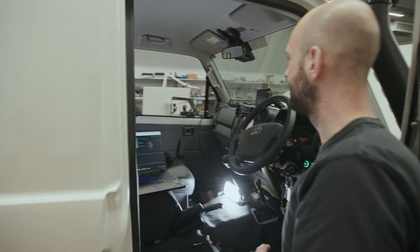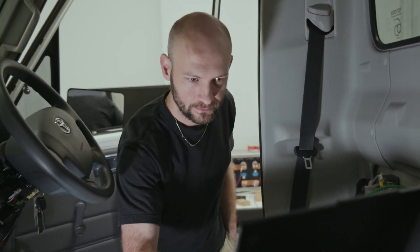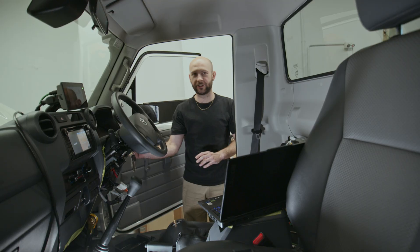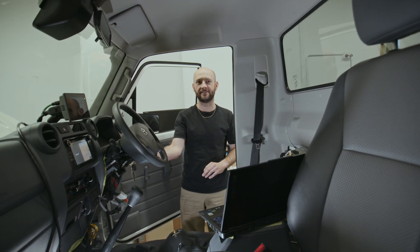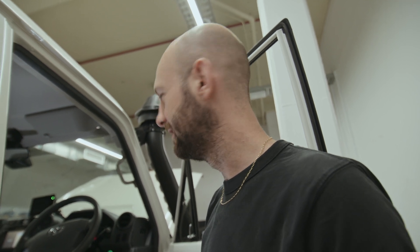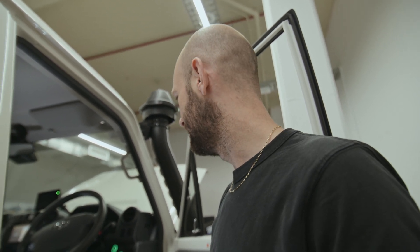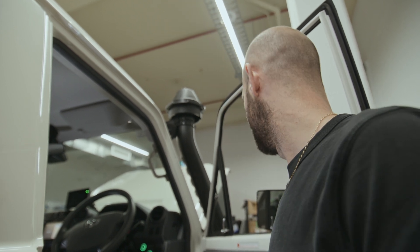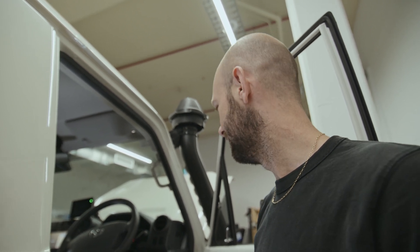Wheels going to go forward. Alright — electric neutral, and we're going to crank again. We've had some issues with our detection of it being in the running state, and we think we've found a fix and we're about to deploy it — about to test it for the first time. We have currently just been testing electric forward and electric reverse, and have stable control of those systems, which is great. Now the real test is getting control of both the diesel and the electric at the same time and making sure everything stays happy.